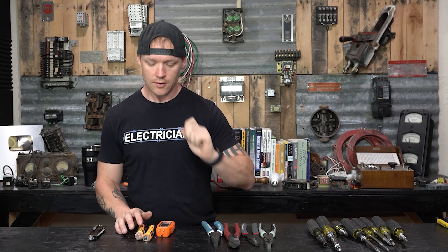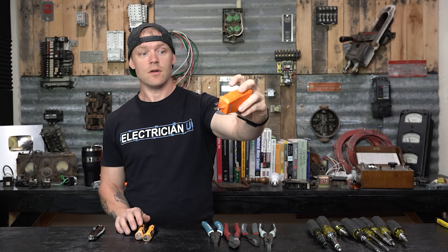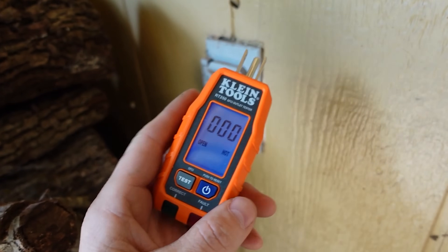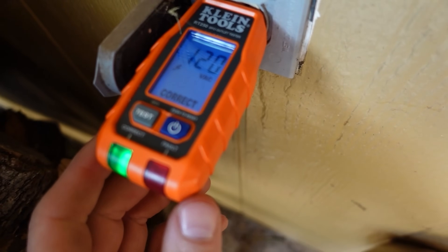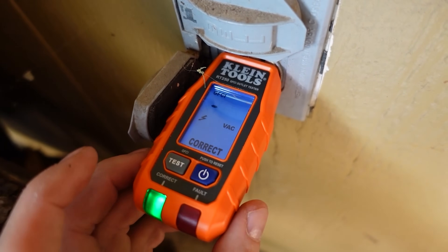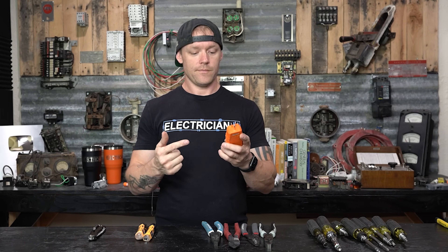Now let's get into the realm of the testers — I'm calling these multi-use because they do a couple of different things. This plug tester is the coolest thing I've found in a long time. You can turn it on and it actually reads voltage. It tells you if things are correct or reversed — reverse neutral, hot and ground flipped, all of those different things. It has a test button so you can test GFI, and it even has a battery gauge that shows battery life once it gets low. I'm never going to use a regular plug tester again — this actually gives you voltage readings, replaces having to use a multimeter when doing receptacles, and gives you the GFI test option as well.